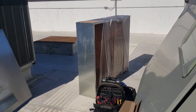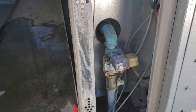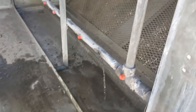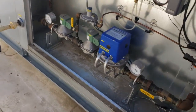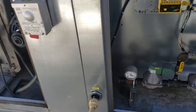We've got a new pad - a whole new assembly. I've got a new water valve because the water valve is bad. There's no power to this unit, it's completely shut off and the water valve is stuck open. So we've got a new water valve, and then we're going to pull these misters since we're in here and soak them all in ice machine cleaner. We've also got a new motor pulley and some new belts, so we've got some work cut out ahead of us.